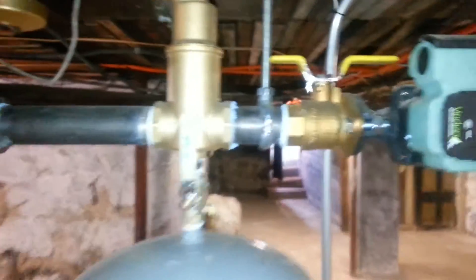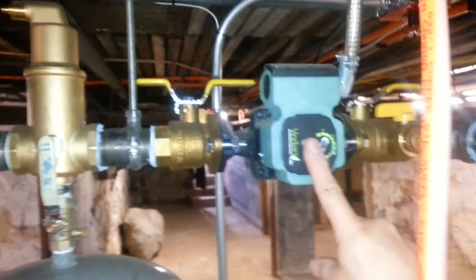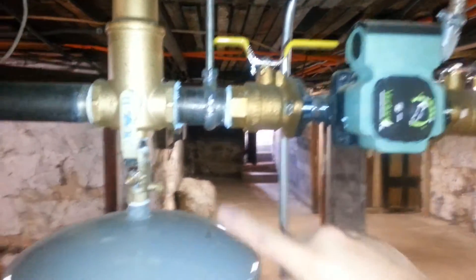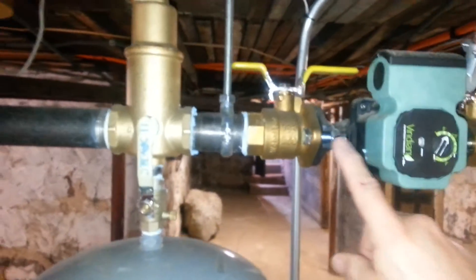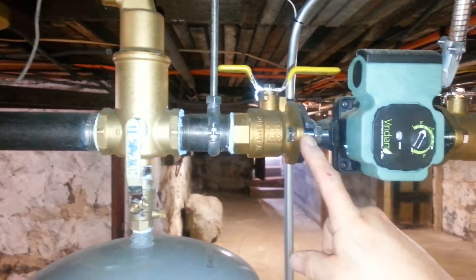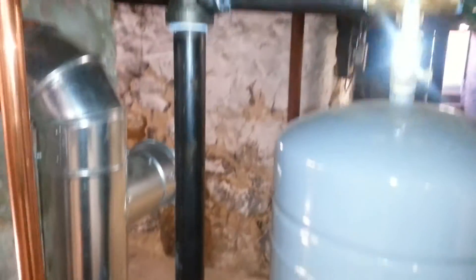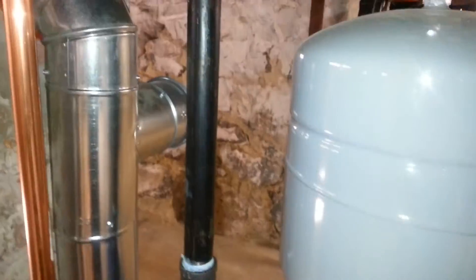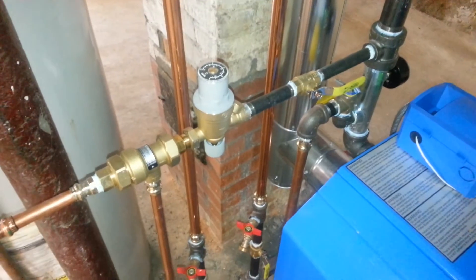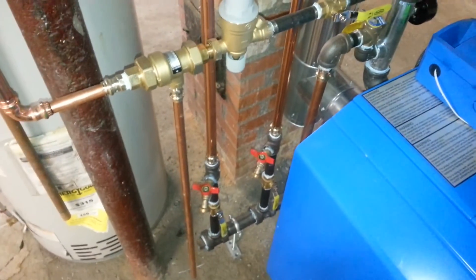I have it isolated, and I also have the suction side on the expansion tank, which is not code, but it prohibits pumping directly into the tank. Here's a draft regulator and return piping. Here's a Caleffi combination backflow preventer and our purge setups.